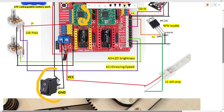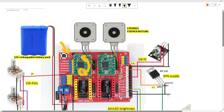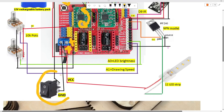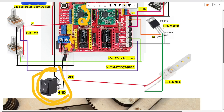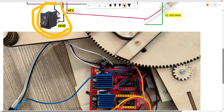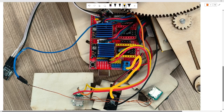Now we can look at the power switch. From your power source, whether it's a battery or a 12 volt source, the positive goes to the positive pin on the CNC board, and the negative will be broken by our switch. So we need to do a little bit of soldering. You can see I put the power switch here — from negative we'll solder on one side, and the other side will come from our power source, whether it's a battery or our 12 volt adapter.